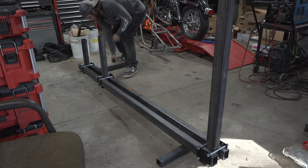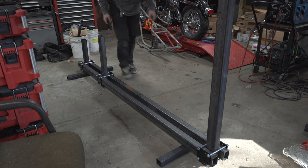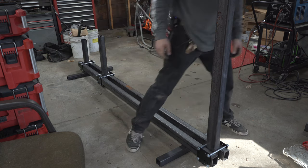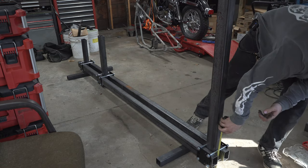And finally, the base clamp for the rotisserie bracket upright. The uprights need to extend below the main rails for structural reasons. The directions recommend using a couple scrap pieces of two-by-fours, which will leave you with an inch and a half overhang. However, I'm going to use two-by-two tubing since I've extended my uprights, and I'm not worried about losing a half inch of adjustability. The directions also recommend extending your main rails past the uprights one inch, but I'm going to match the two inches below since I've also extended my main rails.